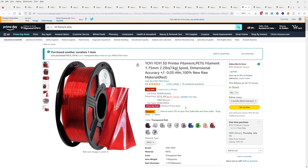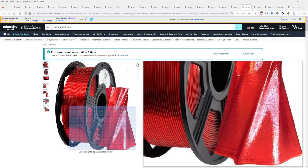They're not the driest filament. I have had rolls come in slightly wet. If you print too slow, they might snap, crackle, pop a little bit. But if you bump the speed up a little bit, it usually stops. But you might need to put it in a dryer. But still, not bad for a trans PETG for the price.